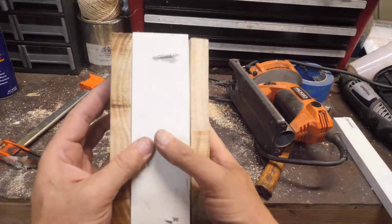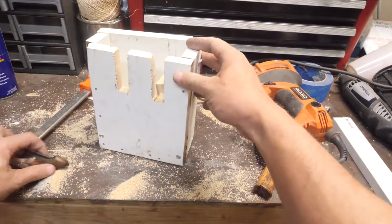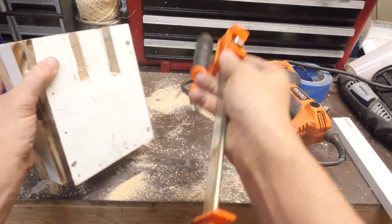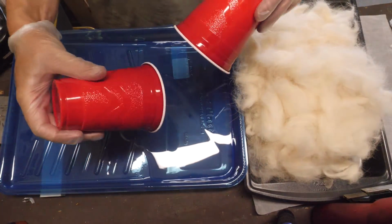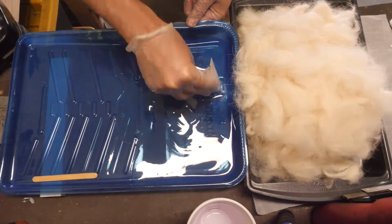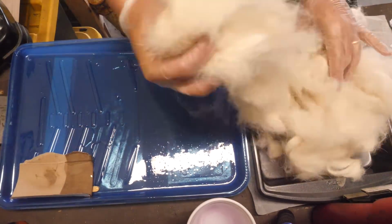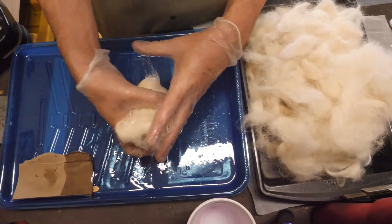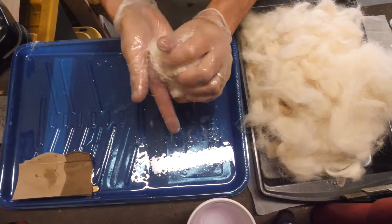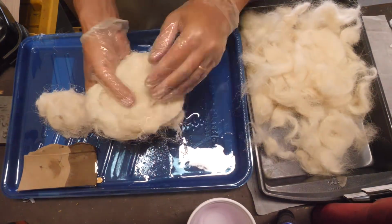Now it's on to our new form. We can make sure we have enough fur this time, not only by gathering more, but by building a form to a shape that's closer to the final shape of our knife. As you can see here, the construction on that didn't go all that well. One thing that might help is that our epoxy has a 40-minute work time this time around and demolds at 24 to 48 hours, so I have plenty of time to both press it with the clamps and wrangle it into a pressure pot to help get the bubbles out. I didn't really show you guys on the first block, but there are these tiny little bubbles around some of the hairs.